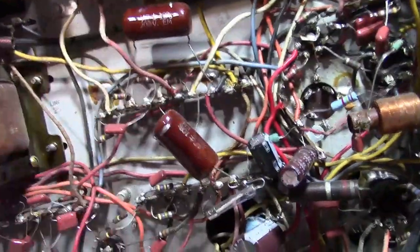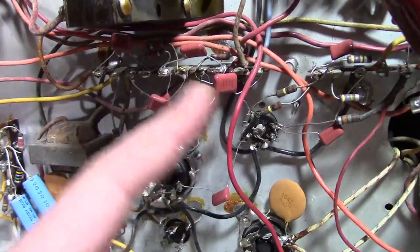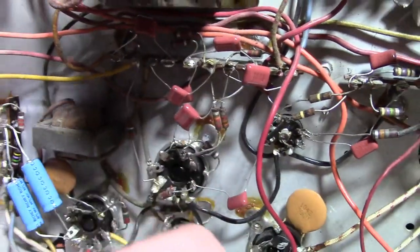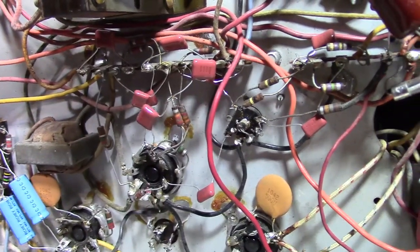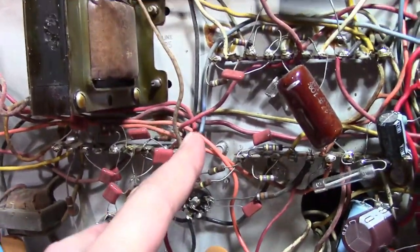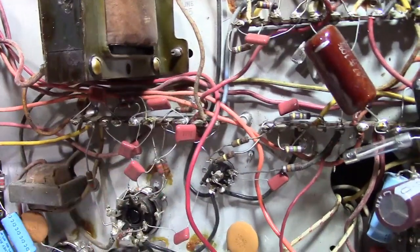And then, as I mentioned earlier, these guys, I'm inclined to replace all of them with something more akin to this. And see if I can find a single part for this one that they doubled up some caps in series. When you put caps in series, the value gets divided. In the case if they're the same value, it gets cut in half. So we got two 0.022s in series. That would make it a 0.011 microfarad cap. As many of these are all 0.01s. So clearly they had some, but that's a pretty long span. And one of these guys wouldn't be long enough. So I wonder if they did that just instead of using a single .01 and an extension lead to it.